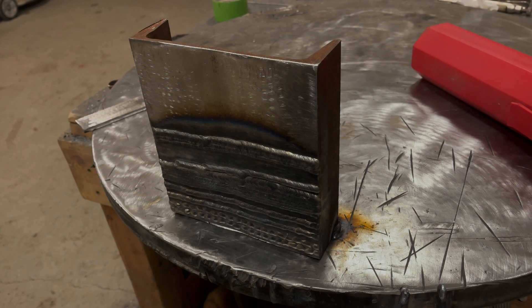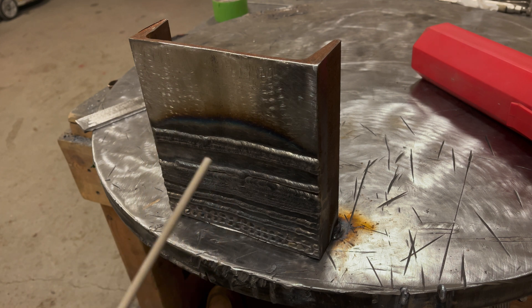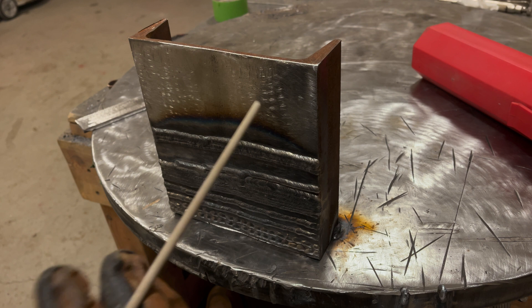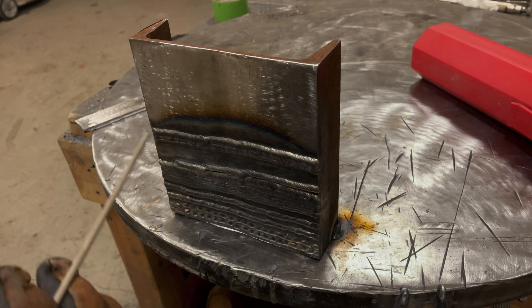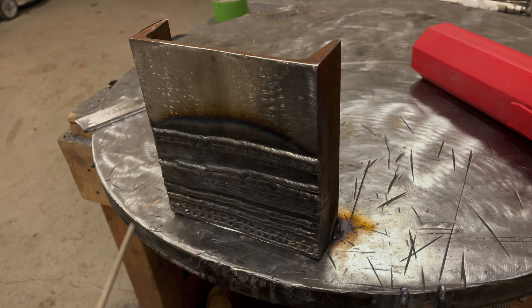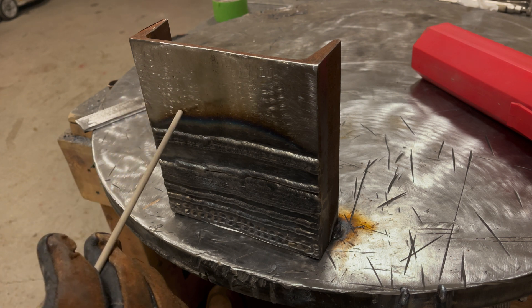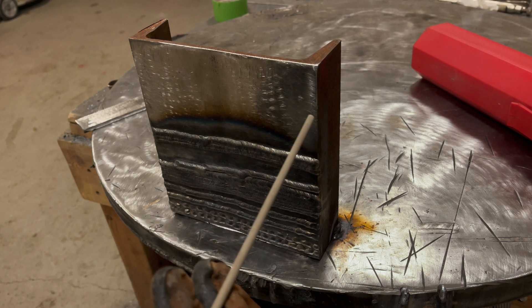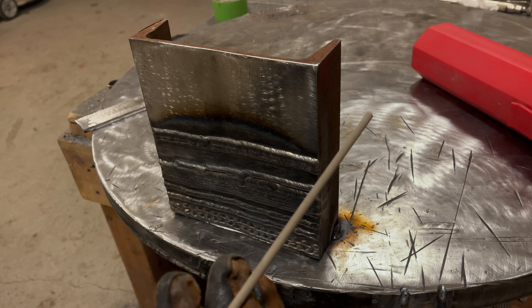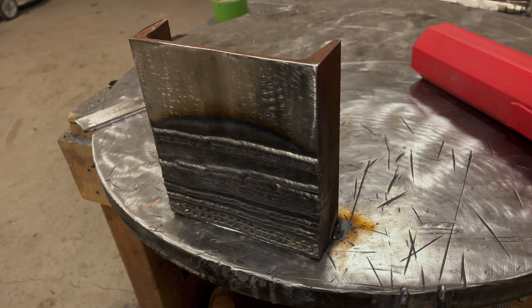Anyway, let's get into it. Here we have our test plate from a previous video — we're going to be practicing on this first, doing our horizontal welds. If you're just starting out on horizontal welds, it may help to take your scrap plate and run a single pass near the bottom or halfway up. That will give you a ledge to weld to. When you're first learning in the horizontal position, if your arc gap is incorrect or your travel speed is too fast or too slow, you'll have a tough time running a single pass with no ledge.